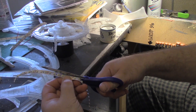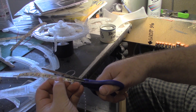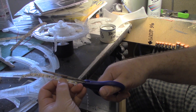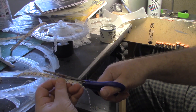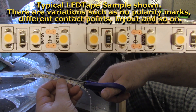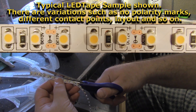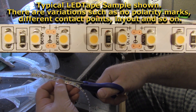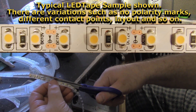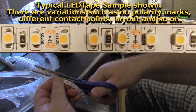When you're trimming the LED tape you can use normal scissors. You can technically go down as far as the solder points. However, there are some black alignment tabs that look like paragraph bars or brackets, and you can use those as a guide for your scissors.